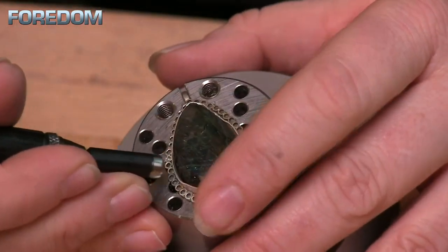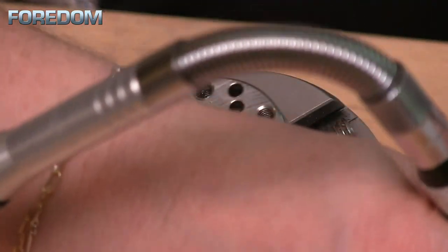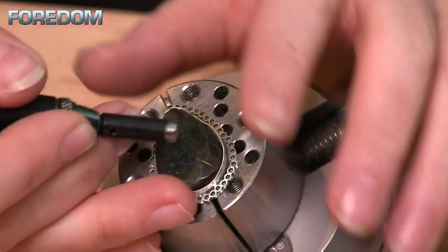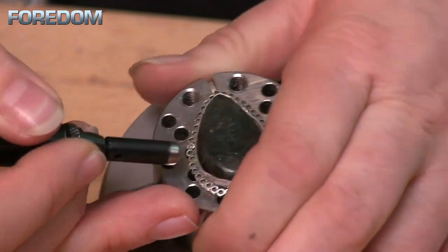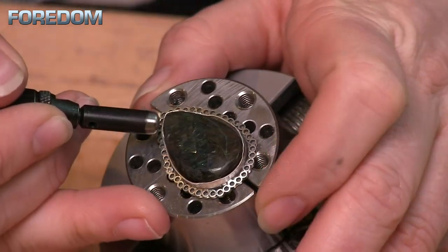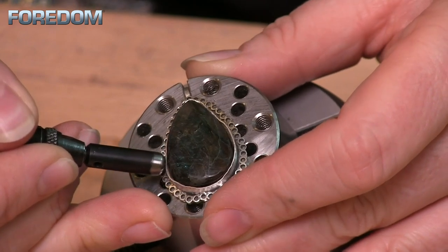Now that I've got that, I'm going to come in. Notice that with this ball vise, it allows me to rotate this so that I am in line with my handpiece. I don't want to have to come up at an extreme angle because of the flex shaft angle — that's what we need to really be careful of. By doing this with a ball, I'm able to bring the angle to the right place without placing too much bend on the duplex spring. I don't want to hit the stone; I don't want to hit directly on the side. I want to bring that bezel down and against the stone, so I work at about a 45-degree angle bringing that down and in towards my stone. I'm going to start here at the top of the stone and just bring this down and around, working very, very gently and making certain that I'm only hitting that bezel.